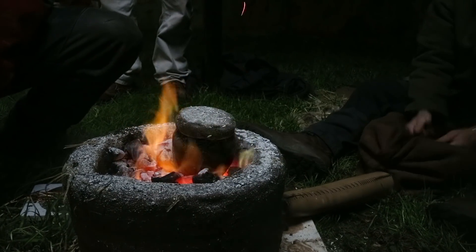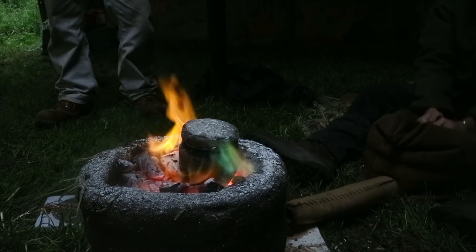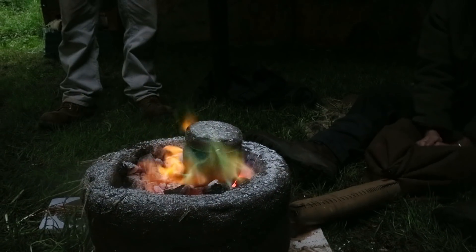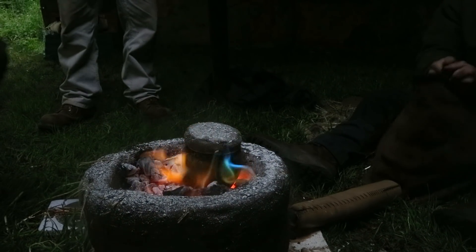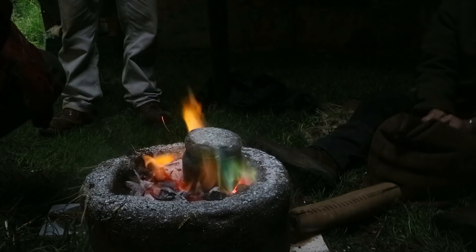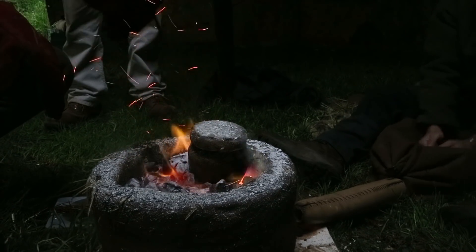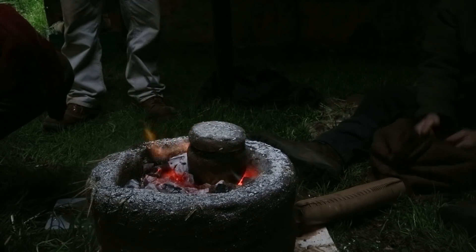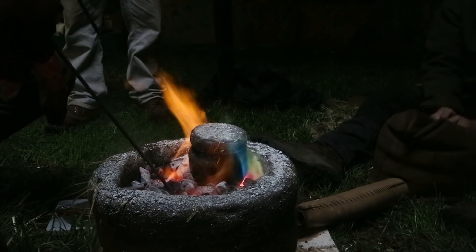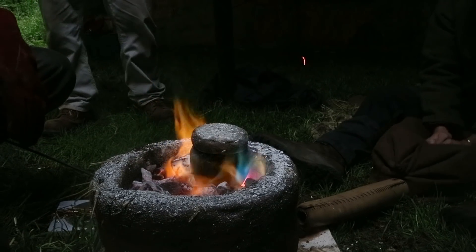What I did is I had a crucible and I roasted the malachite in that crucible. Once it had all gone black, I turned it over and poured it in. Now it's percolating — up here it's not hot enough, there's too much oxygen. So it's going to go down here, accumulate around the entrance where it'll be nice and hot, and that's going to burn off all of the copper oxides and leave the copper.